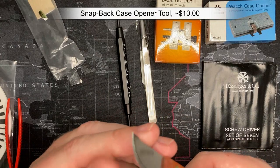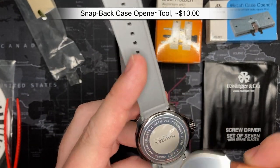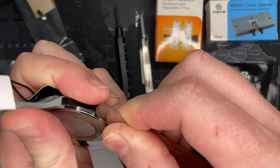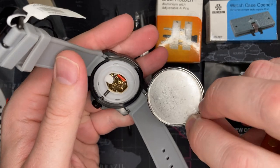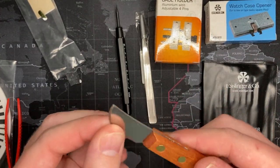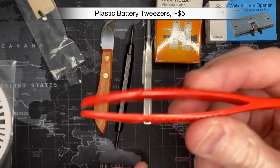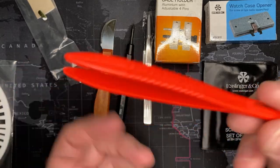This might look like a little cheese knife but it's actually for when you need to remove snap-on case backs. You have to be very careful because you can cut yourself and also damage the case. You need to look for where there's a slight difference at the edge of the case — that's where you go and pop it. And you know what, I'm going to do it because I have to open this one. Oh, there we go! Perfect. Oh, it's gold — I'm going to take a picture of that one later. This is definitely one of the better case opening knives I have, and you can sharpen them.